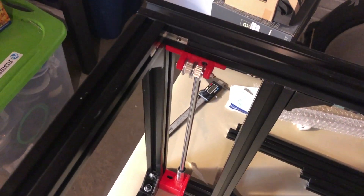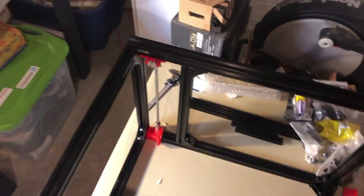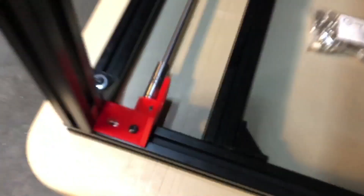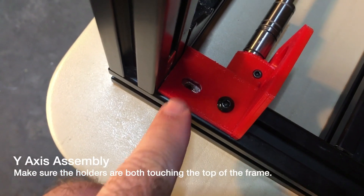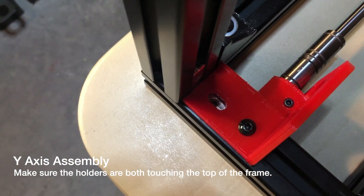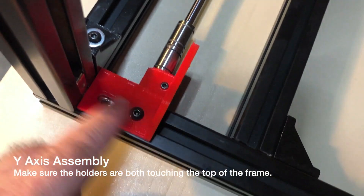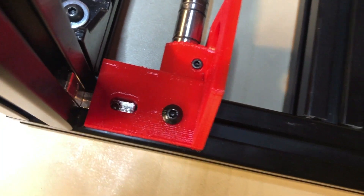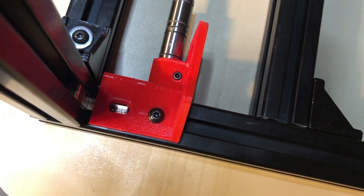I went ahead and dry fit my pieces in. From top down you're looking at the back towards the front — the motor mounts are going to go on the front and the idlers in the back. I've got both the Y axes on. The only part left is to remove the set screw and then tighten that with an M6. What I ended up doing is dropping in T-nuts and rotating the frame — you have to drop them in several spots and then put M5 by 10s in there. It's kind of challenging, but not too bad.